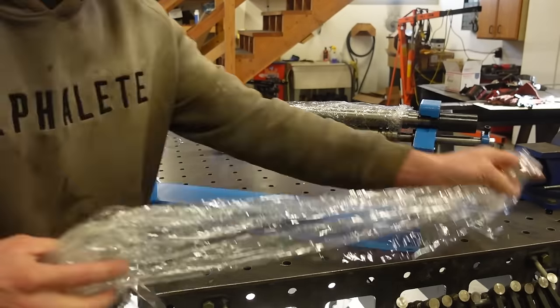So I've never used one of these. Basically, from my research, these two knobs here get your pinch right here between these two rollers. You can see it moves it up or down like that, and then this back roller right here is what actually sets your bend radius. So you'll just tighten these up, bring that up. The higher you have that, the tighter of a bend that you'll have. So really not too complicated. You just get your metal in there and then roll it around like that, bend it. I'll actually have this one marked, basically the start and end of the bend here and here, so that we know kind of where to put it in the roller, when to crank up this back roller, and we'll see if we can make this work.